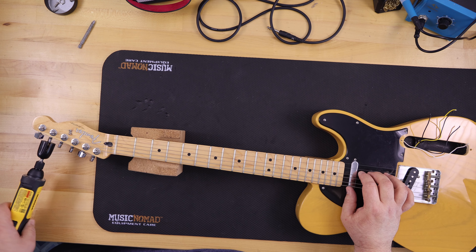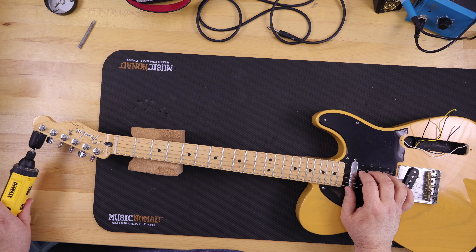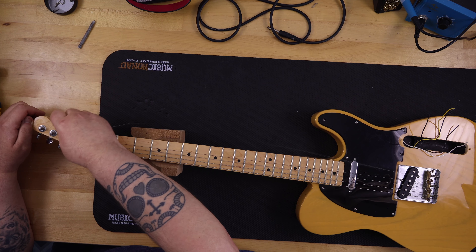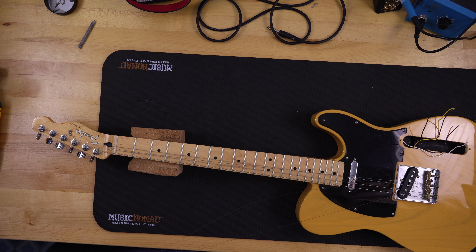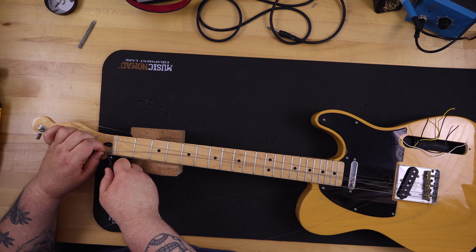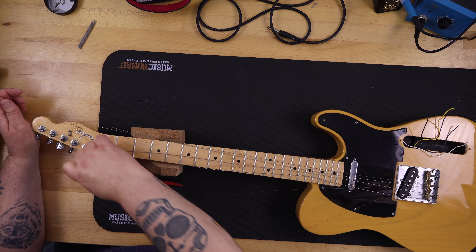For the price you really can't go wrong. I took the strings off, and what was funny is there were strings on this thing but no screws holding the bridge into the guitar body. I looked at the wiring and there wasn't an additional ground coming from the bridge, so I wanted to see if there was a ground under the bridge. When I went to put my hand on the bridge, it just moved out of the way. There were no screws in the bridge at all. There was a ground wire that went from the bridge to the ground of the pickup, which is why there was only one ground wire.